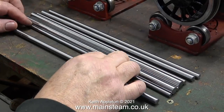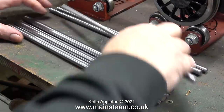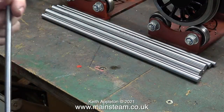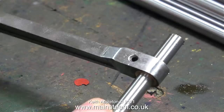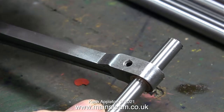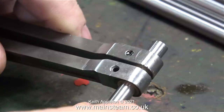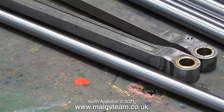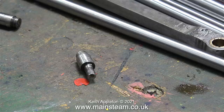Here on the bench are various pieces of silver steel in popular diameters. I only need one piece 5/16ths of an inch in diameter, but I bought a collection to keep in stock, because it's really annoying when I run out of a specific type of metal. This small but important part could be made from mild steel, but it's going to be much better made from silver steel — and the very good news is this accurately ground piece is a perfect fit in the small ends of the connecting rods.